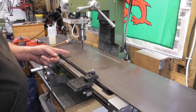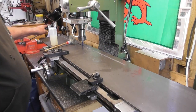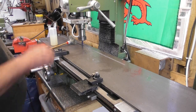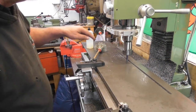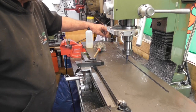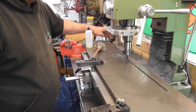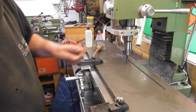Then I think we're going to have to flip the whole part upside down and do the same procedure from the other end, because basically my workbench isn't long enough in this direction to send it out without clearing a load of stuff off the workbench. I'm just blending in now, moving over to do that face to the same dimension. If you look at the end here, I've wedged the tapered handle of one of my small brushes in between the two halves just to keep this back face out — it was closing in a little bit — so it's just keeping it away from the cutter so the cutter's only machining this face of the job.